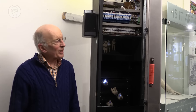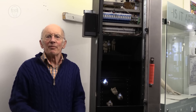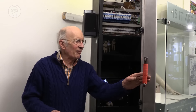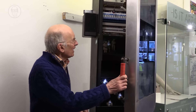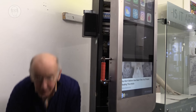After I got the inside working, I could think about the exterior of the machine. The big problem was that mirrors always reflect a wider angle than you expect. I've had this problem with several machines. The only way to avoid seeing things you don't want to is to restrict the viewing angle. In this case, I ended up with a pretty tiny hole — it's just about 150mm high. That's a tiny hole for such a big machine and the only area you can look through. In fact, I had to make a stool for kids to stand on to give them any chance of seeing what was going on.